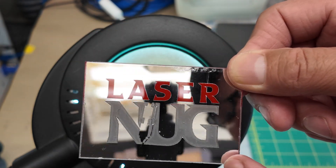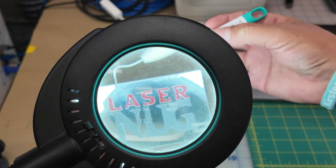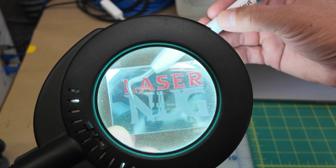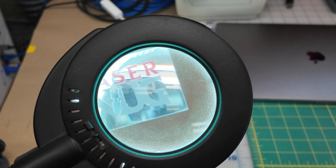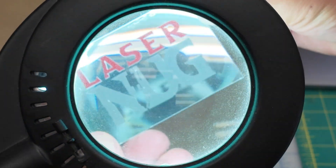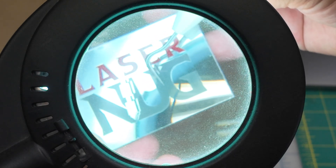Now let's talk about my settings for engrave. I engraved this first test with my normal acrylic settings — my less frosty setting. What I found is it engraved too deep: not only did it remove the mirror coating, but it gave that frosty or clumpy look after painting. All I want is to remove the back metallic coating and nothing more — I don't want to go deep into the back of the acrylic. If I do, I get a painted view of those engraved clumps or chunks of acrylic in different spots.